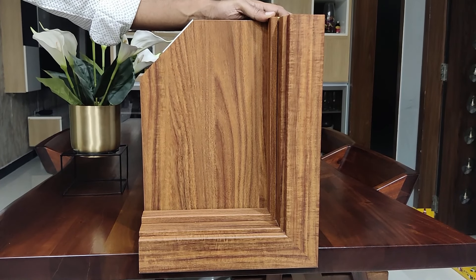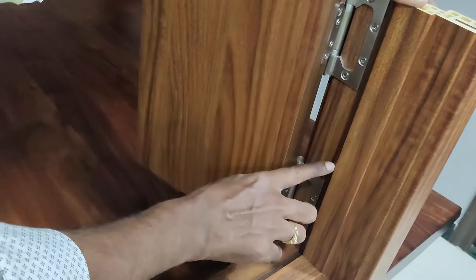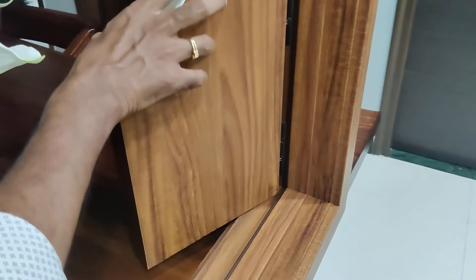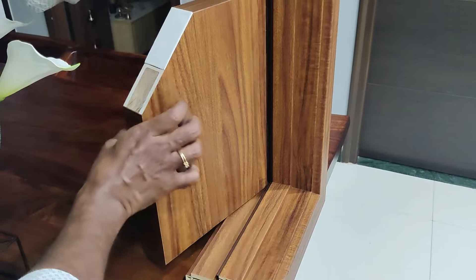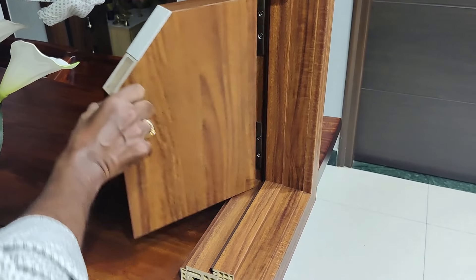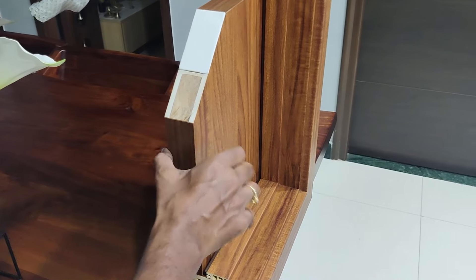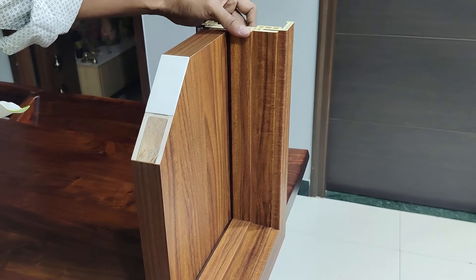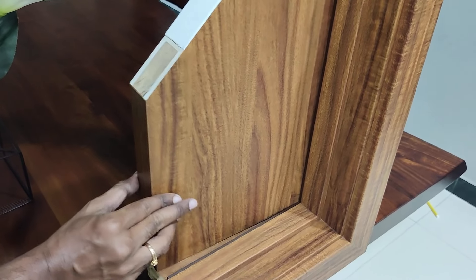Besides the key components, there are two other important items. This is called a gasket — you typically do not find these in traditional wooden doors. The advantage of this gasket is manifold: it acts as insulation, providing soundproofing and energy saving. It also helps reduce the impact when the door shutter hits the frame very hard due to wind or someone intentionally closing the door hard. Last but not least, it stops light from flowing through the tiny gaps between the frame and shutter, helping ensure your room is nice and dark for a well-deserved sleep.